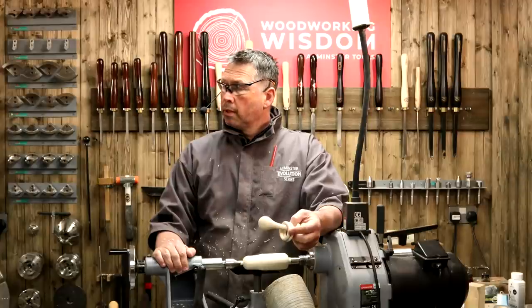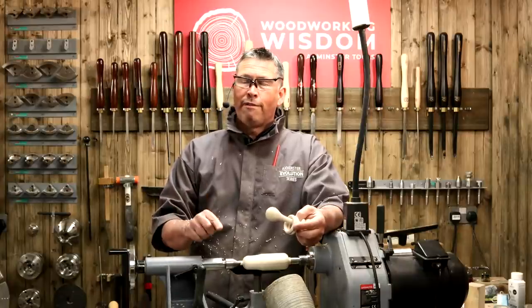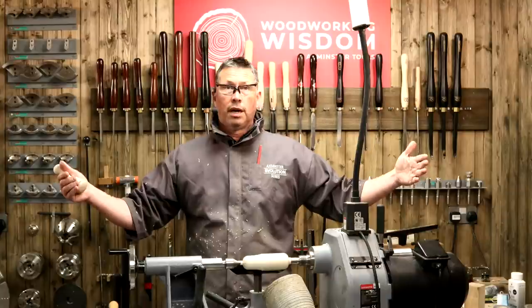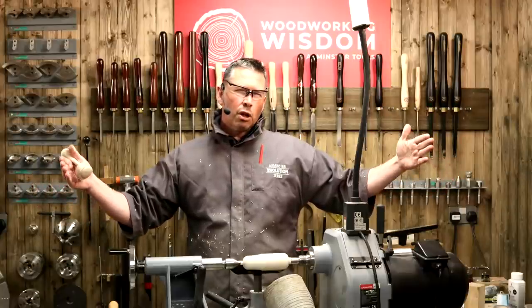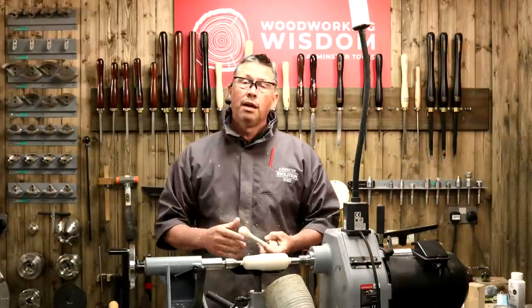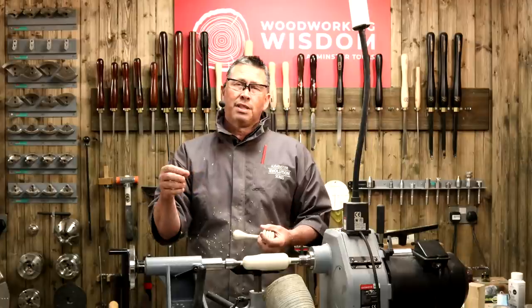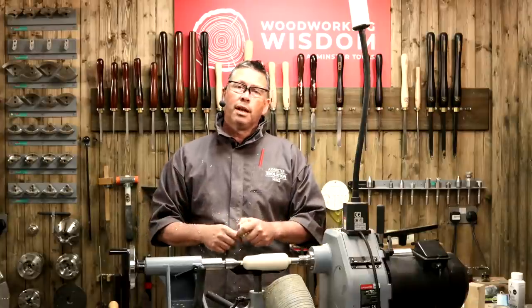Okay, we've got a question from Woodmum Guitar. Can you explain the difference between the AC355 and the AC370 lathe? So the 370, I think I'm right here, 370 is the floor standing machine. 355 is the bench machine. So the differences really are in the length of the machine. So the 370 is, like I say, 1100 between centers. I'm not quite sure about the 355, but it's a lot less than that. I think it's probably about 400 shorter, maybe. I'd have to double check that. But it's a bench machine as opposed to a floor standing machine. The other thing, the 355 has an electronic variable speed. The 370 has a mechanical variable speed. So both variable speed, but one's mechanical, one's electronic.